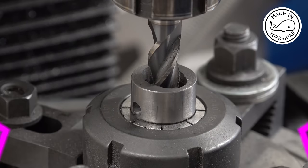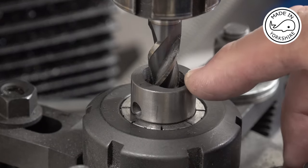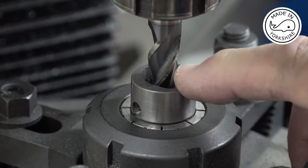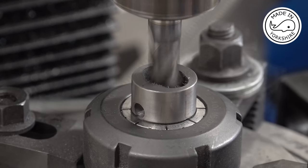Well, having got my brain into gear, I realise now that it's a lot easier to cut this using a standard four flute end mill. So I've moved it down by 0.25 of an inch. This is a half inch 4-flute end mill. So I need to gradually move the x-axis out, making 10 thou cuts until I get to 0.20 of an inch.